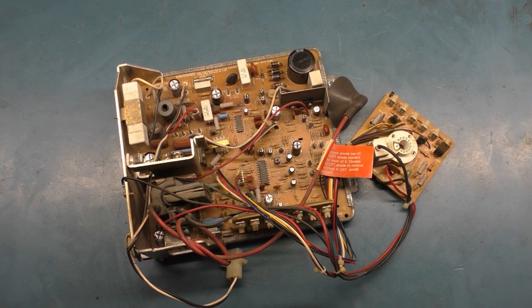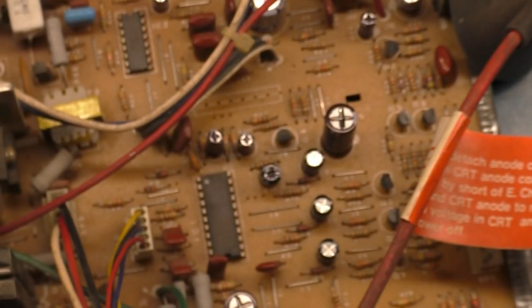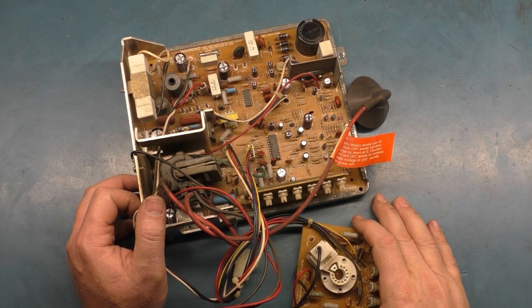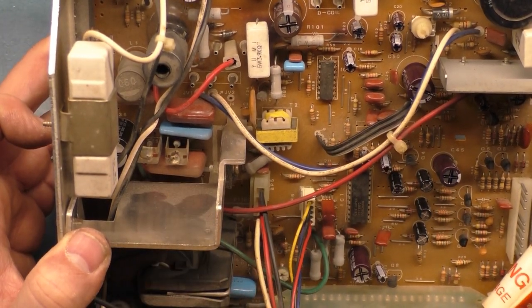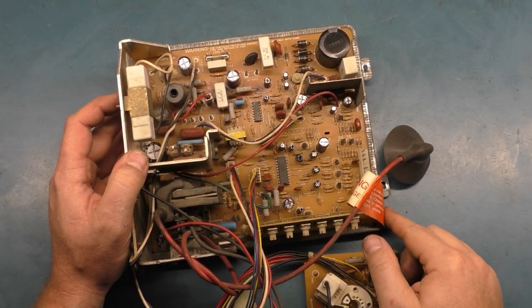Today we have a mystical 19-inch chassis from Sharp Image. We can tell by the label on the neck board that says Sharp Image Electronics, and it's also labeled on the main board. This is an absolute 100% clone of the K7000 — everything is in the same location, same cap kit, same components. There are some slight differences, like D18 is mounted vertically as in the K7000A, and there's an extra diode D29 mounted vertically, but for all intents and purposes this is an exact, identical clone of a K7000.